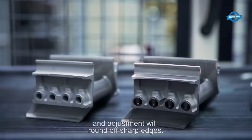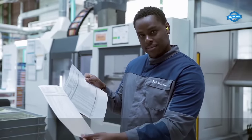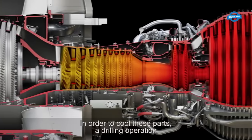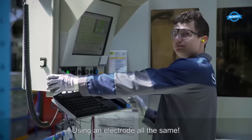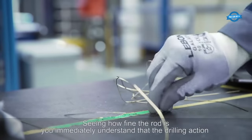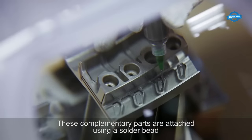Before leaving the manufacturing process, the turbine blades undergo a battery of quality checks, including macro control for general inspection, dye penetrant testing to detect visible surface defects, ultrasonic thickness control, dimensional inspection, and internal health control using digital radiography. The last steps involve laser marking the blades for identification purposes, weighing them for quality assurance, and photographing their position within the box to ensure complete traceability.